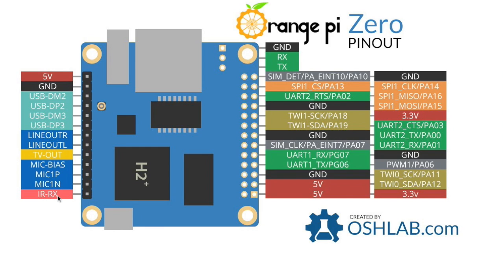So if we connect a NAS to this, the only thing flowing data is the USB ports. So either they're just forking or chaining off one of the USB ports to give you the NAS connectivity, because there's no other way to get data in and out. That means whatever NAS you make of this device is going to be throttled by 480 megabits — the top speed of USB 2.0.